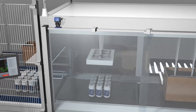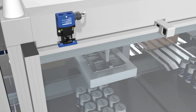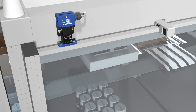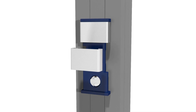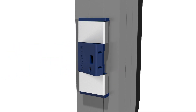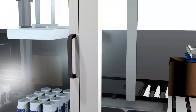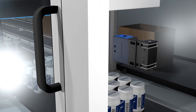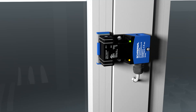The electronic non-contact RFID Safety Sensor RSS16 interrupts any dangerous movements when safety gates on machine housings are opened. After assembly of the support plate, first slide on the stainless steel base plates with shock absorbing pads, then flip on the guard clip and push in the pin for manipulation protection. With operation from the bottom side, the RSS16 is mounted on the door frame without the attached shim. The damped magnetic latching acts in the same way as a door stop, allowing all-round offsets of 2 mm in a single assembly unit.